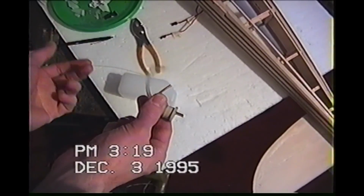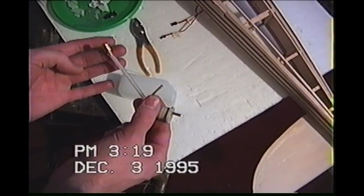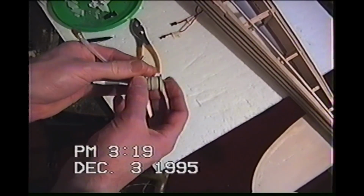But you have just a basic block or tank. That's a 12 ounce there. And then you're going to have the plug-in assembly and everything that's going to go on the inside of this. You got the clunk, which is just a weighted down portion that stays with the gravity, like if you're upside down. And then this tube here is your vent tube, which you route to your muffler in order to get a pressure to your tank. You want to try and maintain a pressure to your tank at all times. That way, if you're upside down, you don't starve your motor.